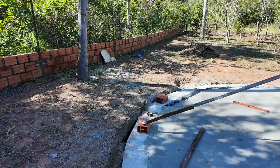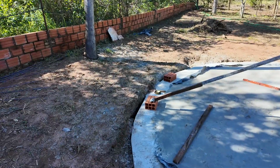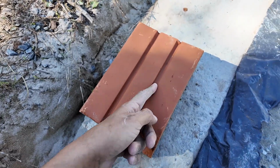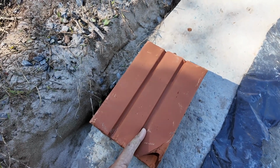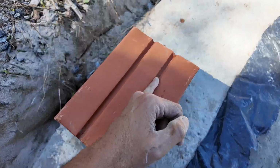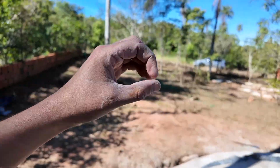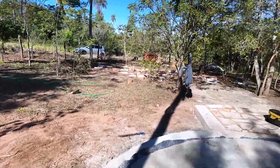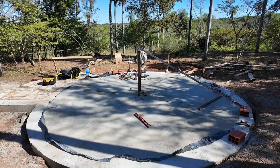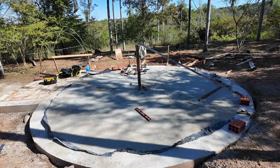Before I lay the bricks, I'm going to buy a reinforcing mesh. It's made out of stainless steel, I think. These bricks have this channel that goes along, and I think what I'll do is, maybe every couple of bricks, lay a really thin piece of rebar in the channel, so that's going to give it some strength as well, so that it doesn't break out. That's the idea. I'm already preparing my mind in case it breaks, because this is the first dome, so we're experimenting. So if it all breaks, that's okay. That's just the way it is.